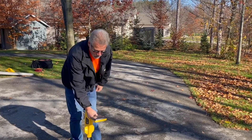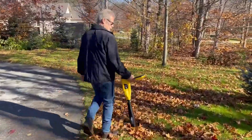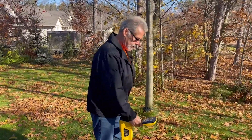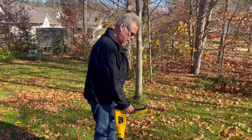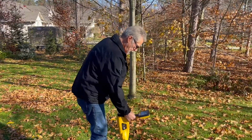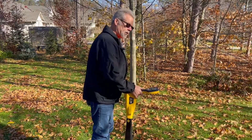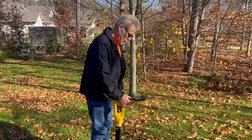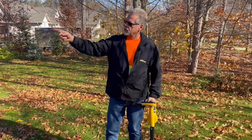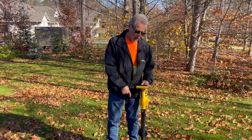I've got about 10 milliamps of current here. Let's go and have a look at that second signal. Here's my strongest signal right here — here's the peak. The null response takes me way over here somewhere. In fact, there is no null response, which is not a good sign. If I place it on the ground, it says eight foot four inches deep. I raise it about a foot up, it now says eight foot five inches deep — another bad indicator this isn't my line. Current measurement over there I had nine and change; here I've got three. So: we made one signal, we're picking it up in two locations, but by comparing peak and null, depth, and current, we can easily see that this is not my line — that's my line.